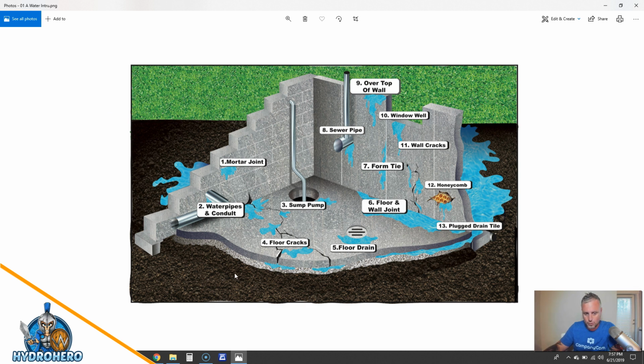You have this virgin soil that's not compacted properly because it doesn't have eons of time like nature compacted it. So when they break ground for your house and then build the house and put your foundation down, it's maybe mechanically compacted, but not what Mother Nature has done. So a lot of water collects in this area as the rain falls. Once it builds up enough, it will come underneath this footer here, and it raises right back up into your crawl space, and it collects around the perimeter of the entire crawl space.